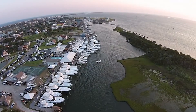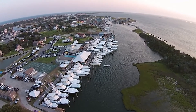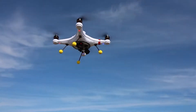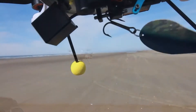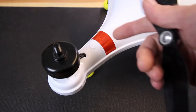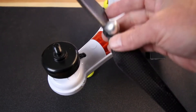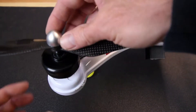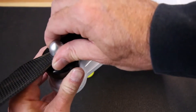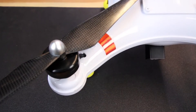The second biggest benefit is that since this is not a Wi-Fi camera, it's going to have a better, higher frame rate and a more real-time look at the water. If you're trying to see waves going by over the ocean in real time, this is your best bet. The camera is housed inside a metal enclosure with a piece of glass in front — you can periodically wipe it off or put a little Rain-X on it. The camera's resolution is 700 TVL, giving a pretty nice real-time view back to your monitor.